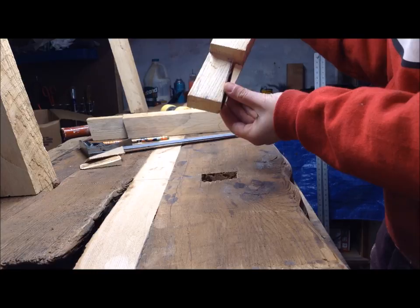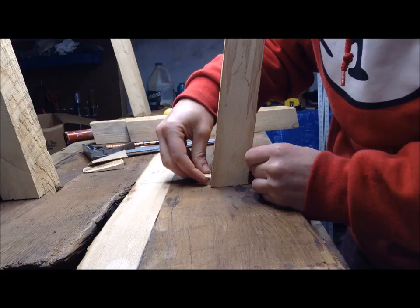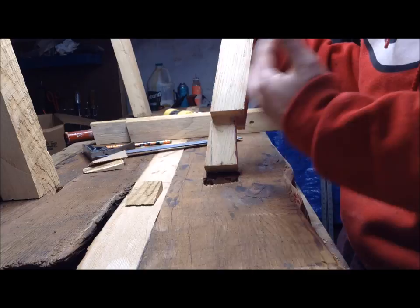Then the tenon can go into the mortise straight and then be angled to that 10 degrees. Then the wedge that I originally cut off of these can be used to fill that space in the front. It's not really what I originally wanted, but you won't be able to tell from the top side that these are cut tenons. They'll look like angled tenons, and I can cut these mortises out in less than half an hour, and it would have taken substantially longer if they were angled.